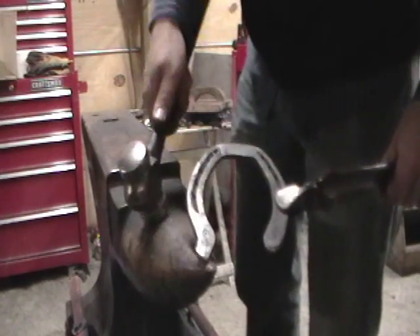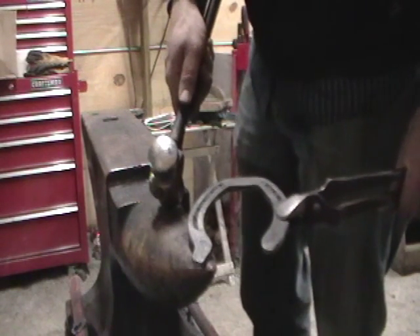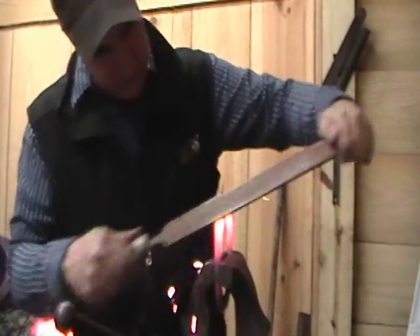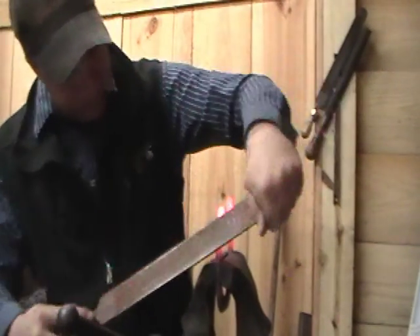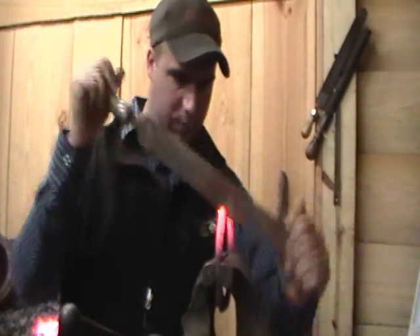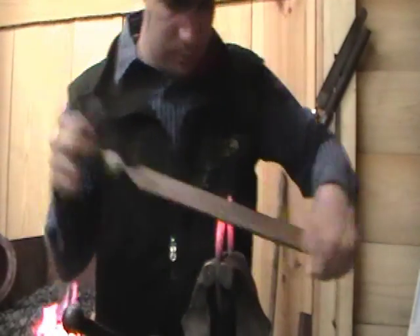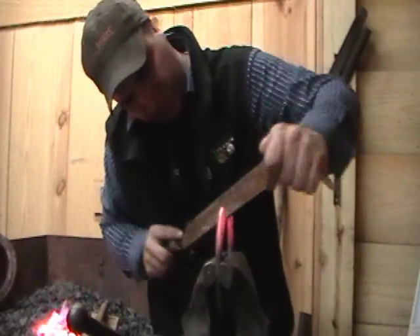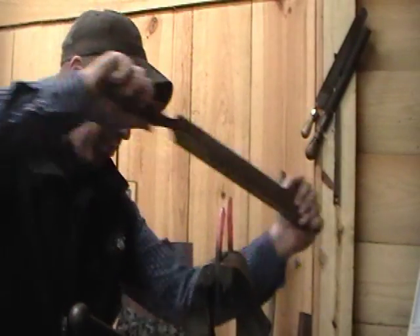There. We've got our quarter pretty well established and we've still got three quarters of an inch out there measured from the middle of the web of the shoe. And we've got it boxed. Go ahead and put your checks in. Make sure to come back and box off this all, clean it up. Mainly removing the cross corners.